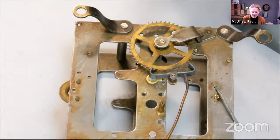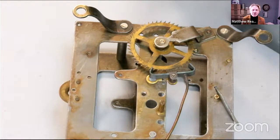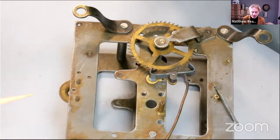is it time to set up the York Clock Museum? Oh, yeah. Well, it's a good point, Sam. So, yeah, I will re-harden the pallets, but I'll just check it all runs first. Because, of course, the beauty of this design is you can just whip the pallets off and you can do that in 2 minutes and then put them back on again and they're done. And, yeah, I'll just put some cool gel or something around there to protect the brass bits.